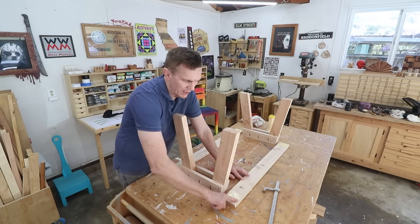You've probably seen this tip before, but if you punch a few holes around that rim of the can, it allows the paint or stain to drain back into the can rather than pool up in that groove. I found that using a foam brush was a good way to get that stain in between those slats.